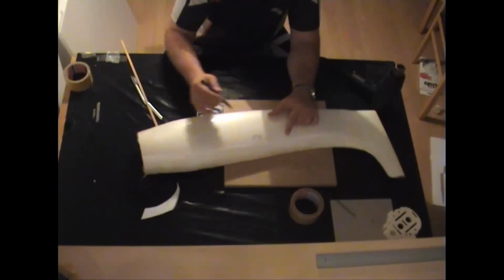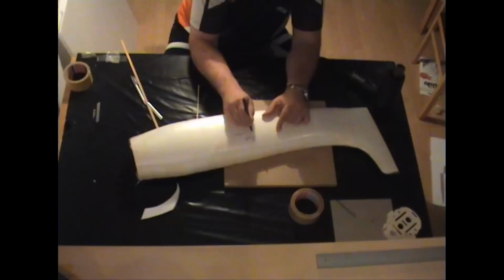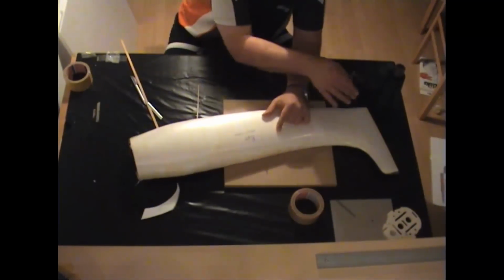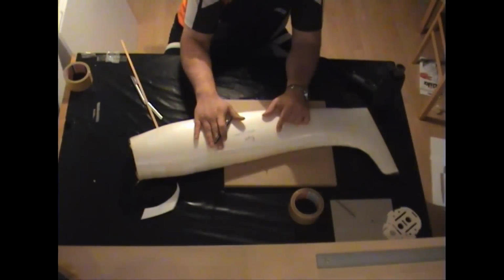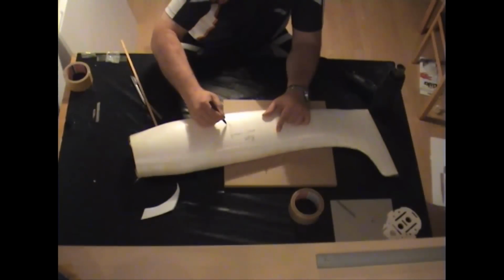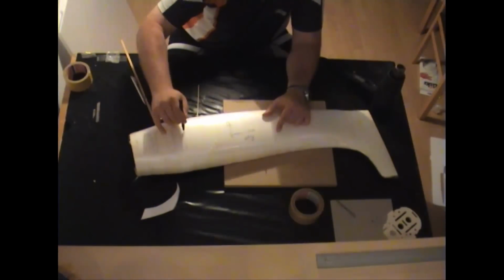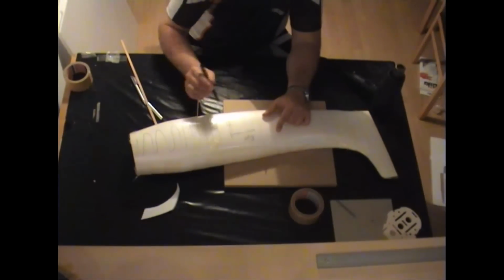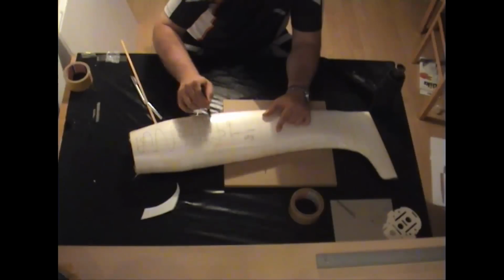Next is that you fan in the long direction, in meanders. So each meander halfway covers the other with the heat, so the material is all through heated. The last step is that you go this direction, also in meanders. Slowly passing, but not burning the material. So afterwards, the material is all through heated this way.